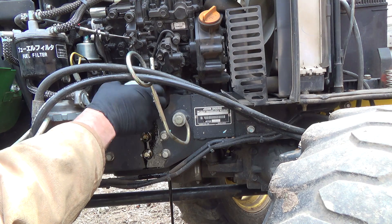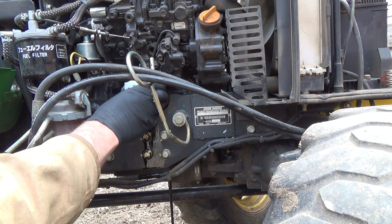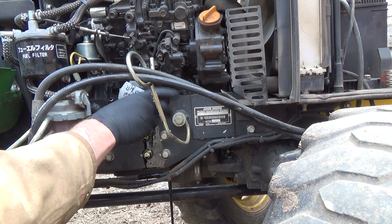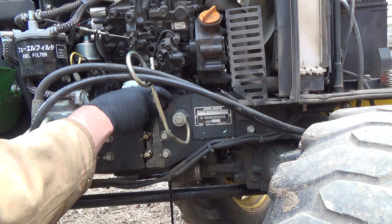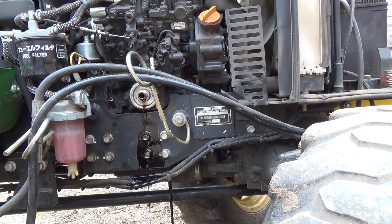This will come right off here now. So I got a new one with the new change hours on it. And 3.4 liters of oil for it. And that should be good. So while that's doing that — it's still dripping out the bottom, just drooling out — while that's doing that, we'll get up top here and have a look at our air filter in this one.